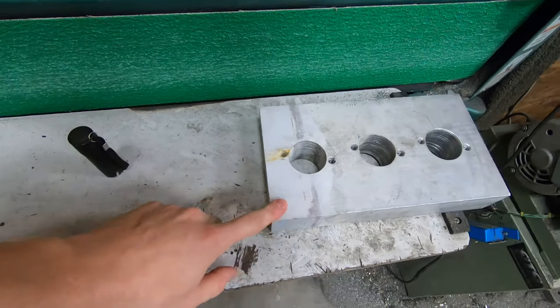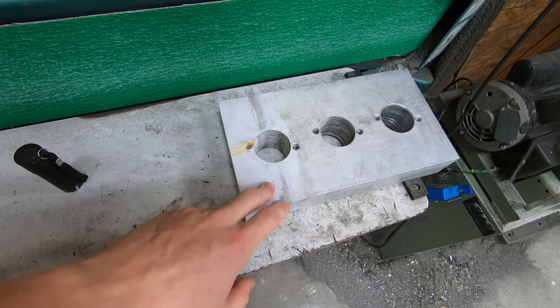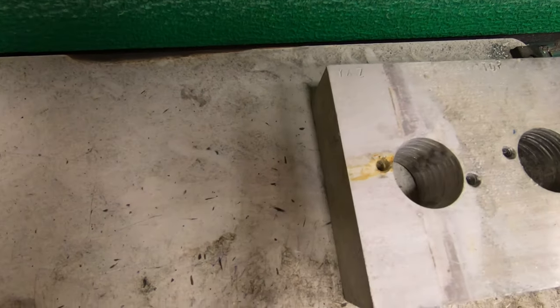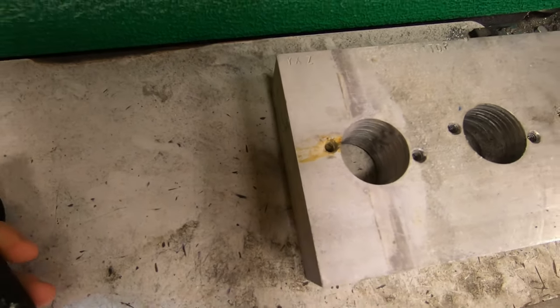There's some discoloration from the water alum mix, but that will come off, no big deal. You can see that there is some orange brownish staining there. That's rust staining, and if I shine the light, maybe you guys can see. Yeah, I think you can see there. You can still see there's a little bit of tap left. Let it soak overnight. Spent 2 entire days trying to burn the tap out. And that's as far as I got. And I am done allotting any more time to try to do this.